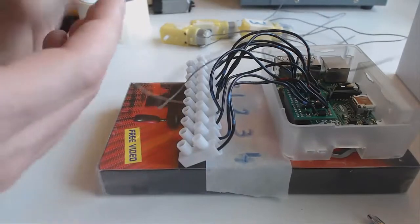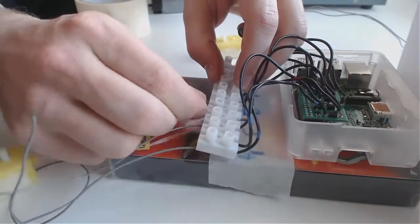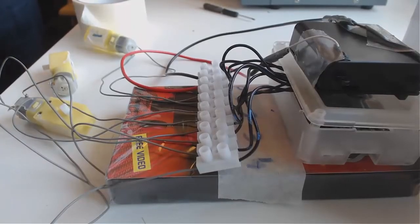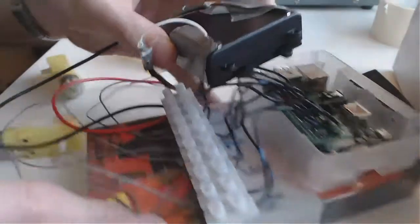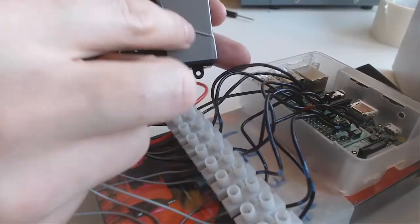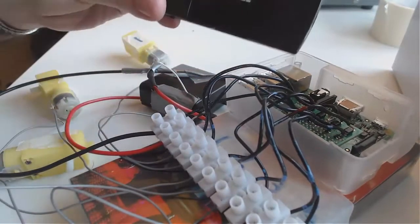Let's take motor four here and put these on. Now it's horrendously messy, but it's almost there. We've got everything done — our motors all connected up, four motors total, and our little power pack connected up. Just a reminder: these are the batteries that drive the motors. You need a separate power source to work your little computer here, your Raspberry Pi. That's why we've got two power sources.